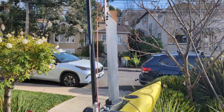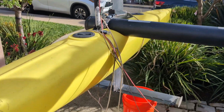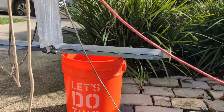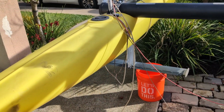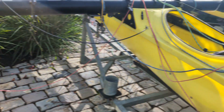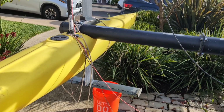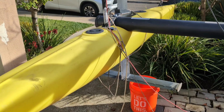You can see this big metal bar holding what would eventually hold the boat up, and then this little wing underneath. Since water is about 800 times more denser than air, that's all the wing we need to keep this 400 pound monster, and then 200 to 400 pounds of passengers, above the water.